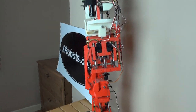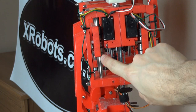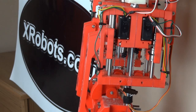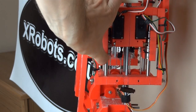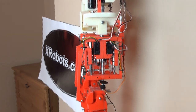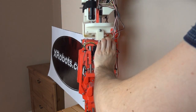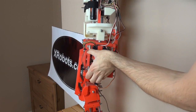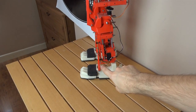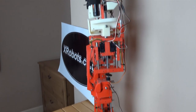Let's have a closer look at the mechanism here. What we've basically got is a pair of actuators with M8 steel bar and these sliding elements on linear bearings which slide up and down. I've got one on the back here which actuates the thigh mechanism to go forwards and backwards, and this one is for the knee. There's another one down the bottom on the ankle, which I've got blocked in at the moment so that it doesn't collapse under its own weight when it's switched off.